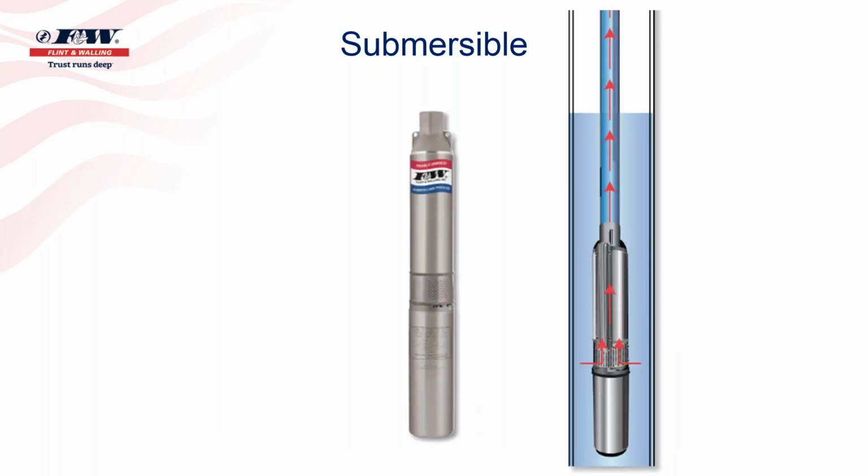When a submersible pump is put into water, as you might see from the diagram, the water enters the suction screen. There is no priming a submersible pump, by the way. Once you put it in a body of water, you can power it up, and it will immediately begin to pump water. But that water is drawn in through the suction screen, which we already talked about, being located between the pump end and the motor. And so as that water gets drawn in, it will be pushed out right up the top discharge.